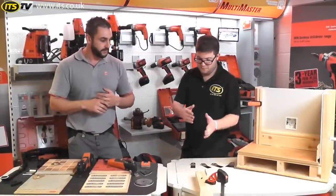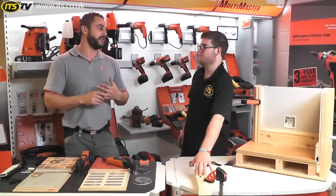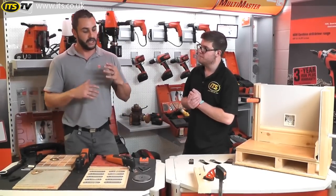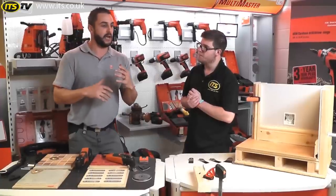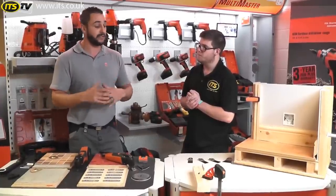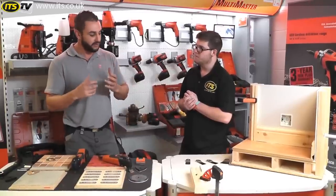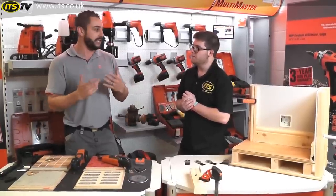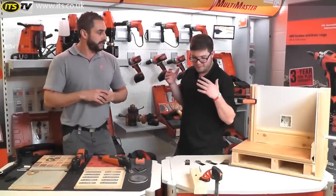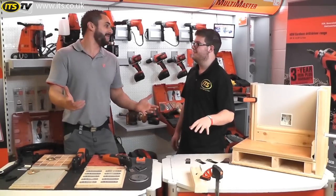Any oscillating tool blade — this is not the sort of application for hardened nails. And it's not just on this — we get a lot of people asking whether they can cut materials like stainless steel with them. A lot of the time the answer is no — the material is so hard and the machine runs so quickly that the heat generated just dulls the edge off the blade. Oscillating tools are perfect for numerous applications, but not this. Everything has its limitations.